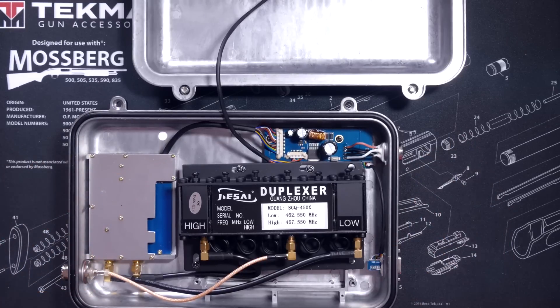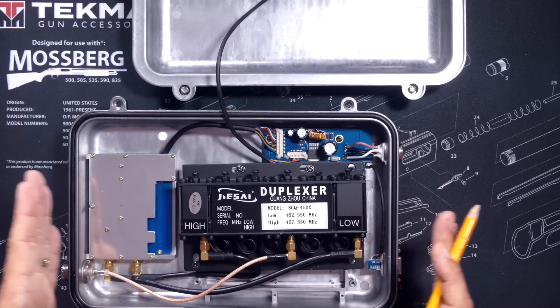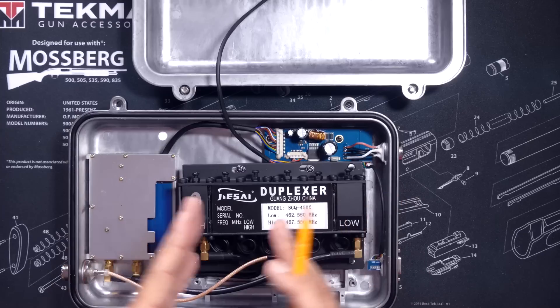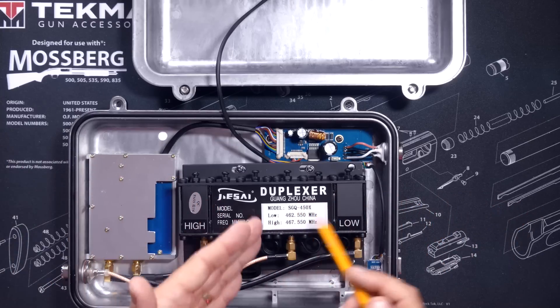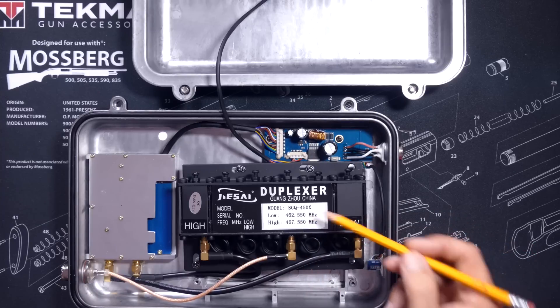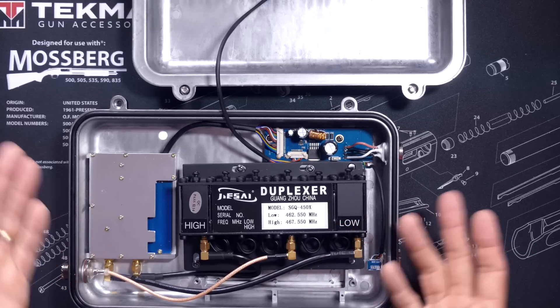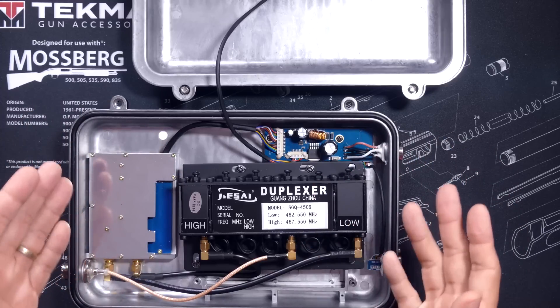There are no radios inside — it does have its own duplexer. Center frequency is tuned for 462.550, so that's where the duplexer will perform the best. It will fall off in performance the further away from that frequency that you use. The internals are locked to GMRS frequencies and there are only eight GMRS repeater channels, so you can't get too far away. But 462.550 would be the best frequency to use. Ladies and gentlemen, there you have it — there is actually not too much to be seen, but you have now seen it.